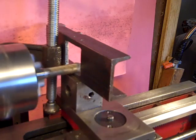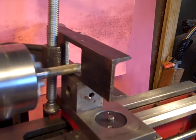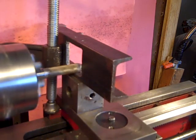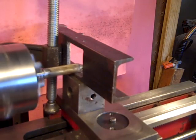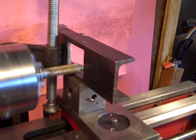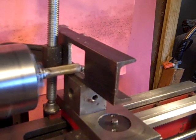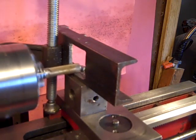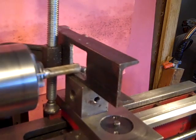They say, oh, you can't use more than an eighth of an inch or a little bigger, 3/16 end mill on a mini lathe. Well, we have a half-inch end mill here. Milling. But it's by no means a milling setup. Everything is bolted and fixed down. To move the depth, even to move the end mill bit in, I have to unlock the carriage, move it, and then lock the carriage again, because the only thing that moves on this right now is this way. But it's working.